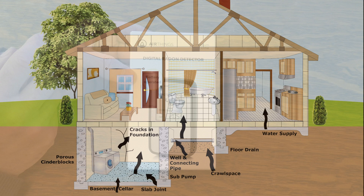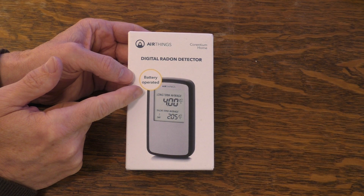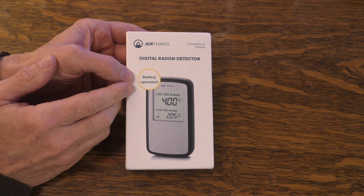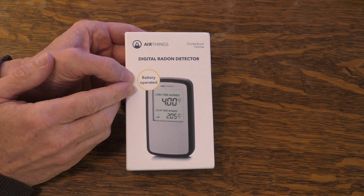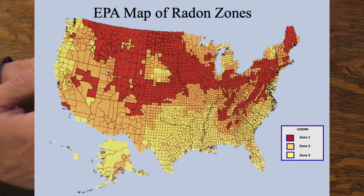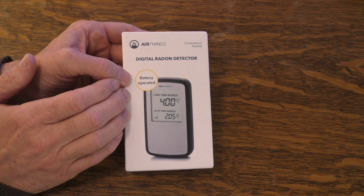There's a lot of radon mitigation out there, but the number one step is to know if you have radon in your home. There are many parts of the country that are more susceptible to radon based on the geology and the type of soil that creates the gas. Here is a map that shows the radon hotspots throughout the country. If you do live in one of these areas, it's not necessarily the case that you have a radon issue in your basement, but you do want to test for radon.